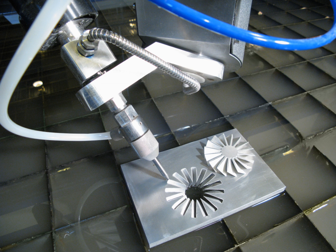Examples of materials that cannot be cut with a water jet are tempered glass and diamonds. Water jets are capable of cutting up to 6 inches (150 mm) of metals and 18 inches (460 mm) of most materials, though in specialized coal mining applications, water jets are capable of cutting up to 100 feet (30 meters) using a 1 inch (25 mm) nozzle. Specially designed water jet cutters are commonly used to remove excess bitumen from road surfaces that have become the subject of binder flushing — a natural occurrence during hot weather where the aggregate becomes level with the bituminous binder layer, creating a hazardously smooth road surface during wet weather.